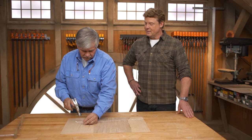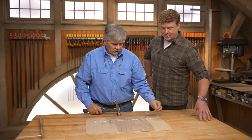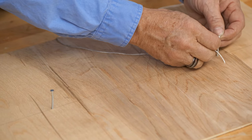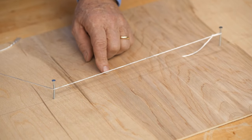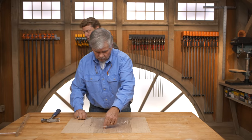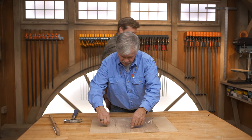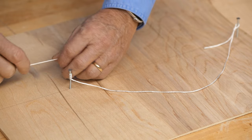Throw a center line wherever you want it to go. Put a nail there — the center line of the board this way. In this case I just use the center of the board, but if you're doing a doorway or something, you have to figure it out a little bit different. So now I have two points that I can put my string on. I have a nail going in that string here. Now before I tighten it around there, I'm going to stretch it out to where I think the top of the arch will be. I'll wrap that around like that and lock it in so it doesn't move.